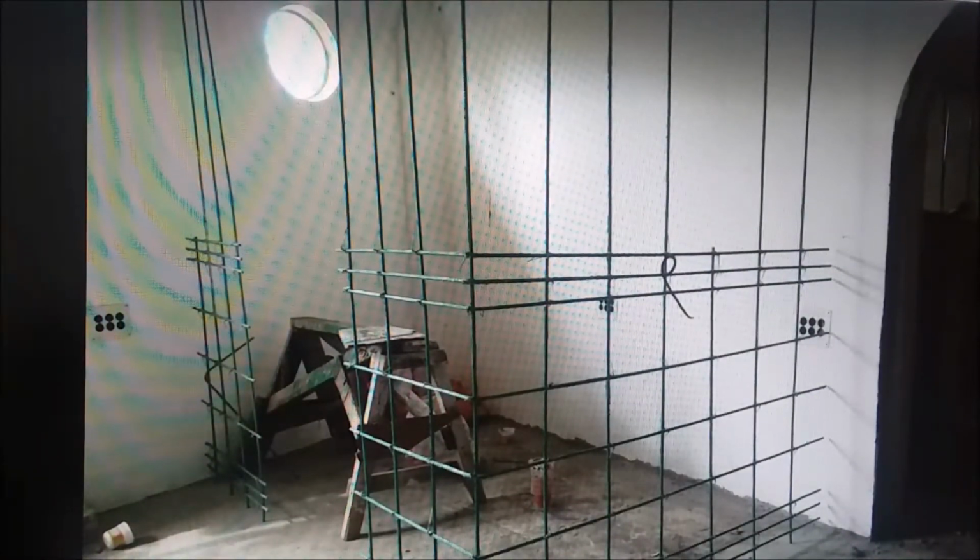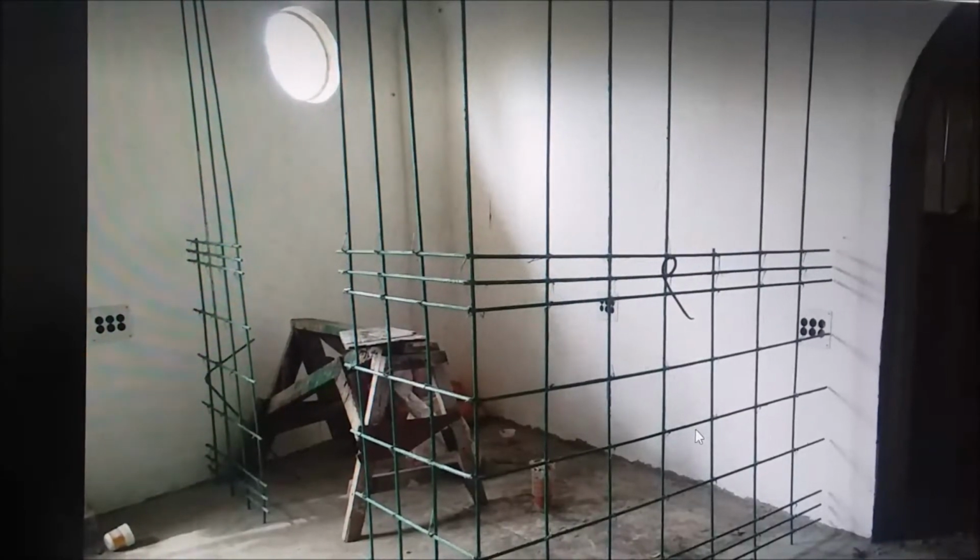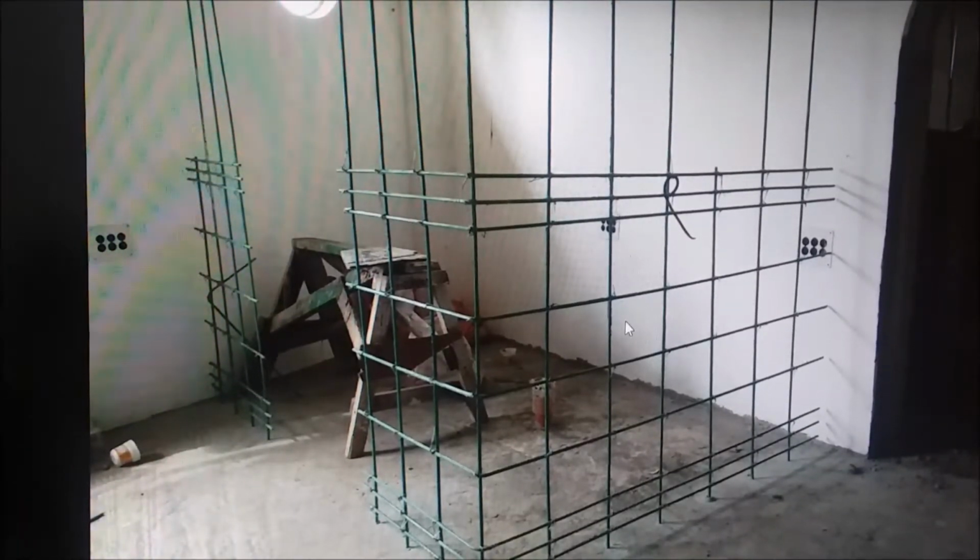This is bathroom 4 of the 4 that are the same. These are like Jack and Jill bathrooms for the 2 bedrooms, I guess. They're en-suite bathrooms. That's what you call them. This rebar pattern, let's see if we can, there you go. You have them closer together near the edges of the concrete at the bottom edge and the top edge, and then evenly spaced between here. That's because it's like tearing a piece of paper. If you can get the edge tore, you can tear the whole sheet.